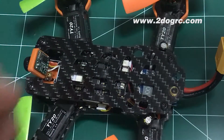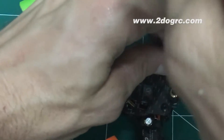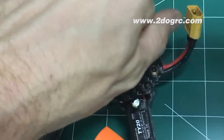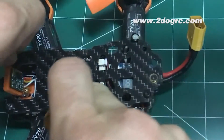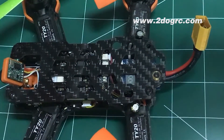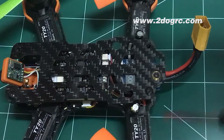I'm going to start here on this 150 to show you basically what I'm going to do. It's really a better idea to have your 12 volt power supply power your video transmitter. I'm going to show you how to take it off of the plug it's in now — which is getting battery power, anything from 3S to 4S — and put it on a 12 volt regulator provided in your ship. This is a Tyrant 150; I'll show you this, then we'll switch to the 180. It works in either ship.